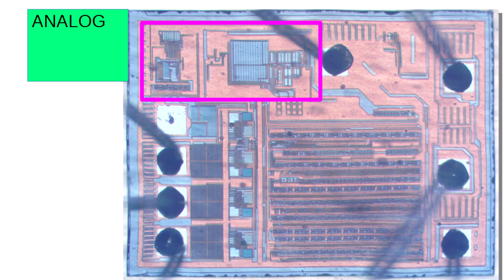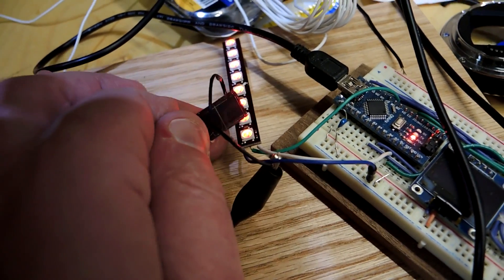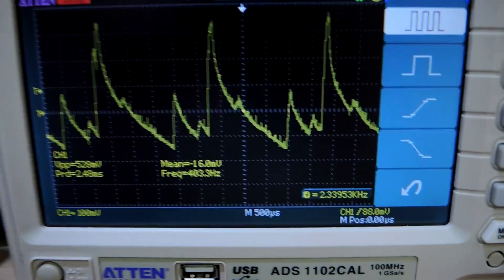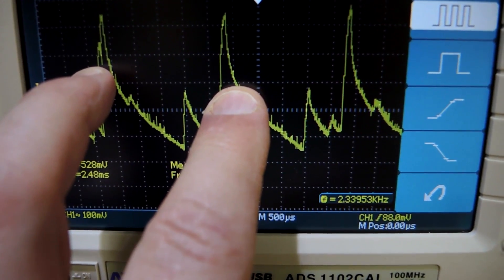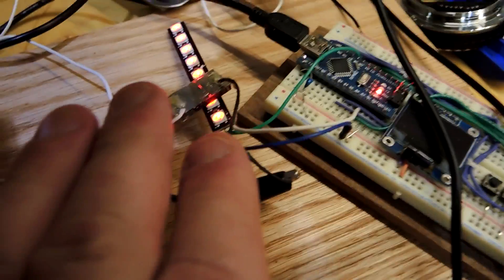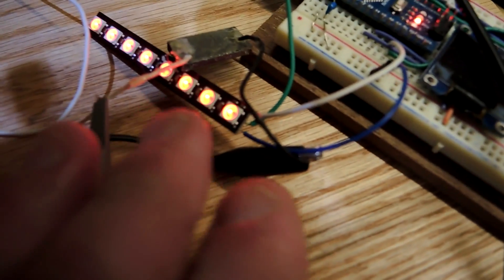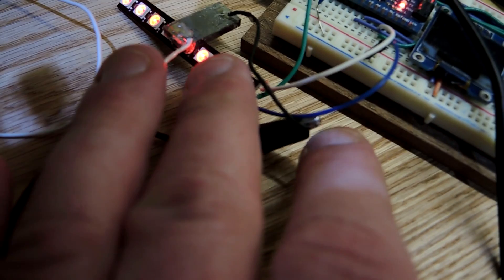On the upper left there are two analog structures. To sort that out, I need to go back to the actual device to see if this IC has its own self-clocking circuitry. I programmed the NeoPixels all to be red, then used a solar cell to convert light to electricity. Turning off all the lights, I captured a repeating pattern — pulse width modulation at a frequency of about 400 Hz. I pulled out the data lead and the NeoPixels maintained their programmed pattern, confirming there's a built-in timing circuit on the die.